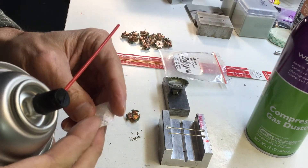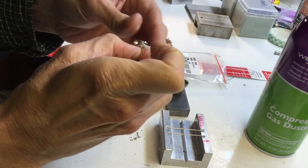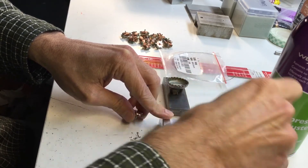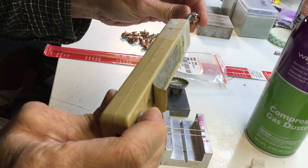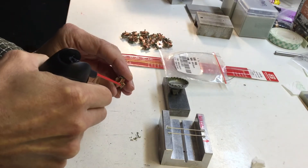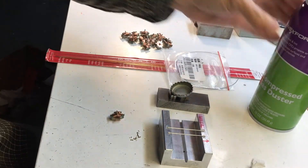So let's go through the process of prepping. I've got a little piece of paper towel here, I'll put the cleaner on it and make sure those armature shafts are nice and clean — run that around a few times. Then I'll clean off my balancer, demagnetize it — just press the button, hold it up there and demagnetize everything. Then take the compressed air and blow the dirt off. I'm basically ready to get started now.